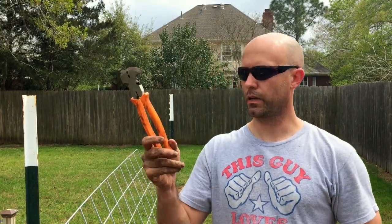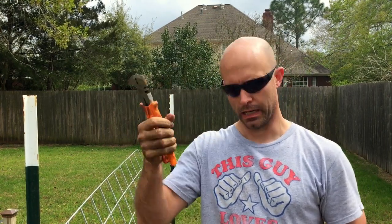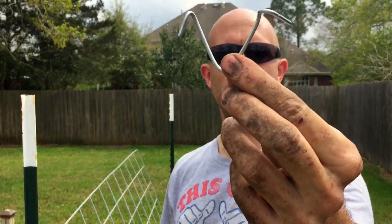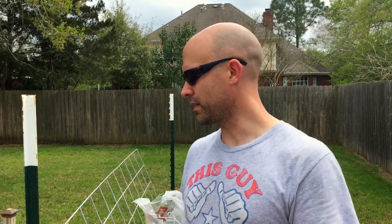For the next step, I've got a fencing tool but you don't really need one — you can just use a screwdriver. You're going to need t-post clips. You can pick these up at Tractor Supply, same place I got my panel. The panel cost me $14, and a bag of 50 clips cost about $4. With two panels up, I'm in at about 30 bucks total. It doesn't take long to put these up, as you can see from this short video.